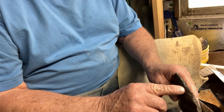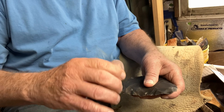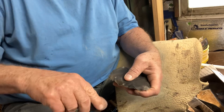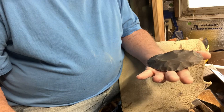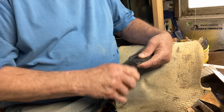I've got this continuous platform through here. It's a flat spot there and a ridge here — I'm going to go over and hit it where the ridge is. I'm not going to worry about that continuous flat spot right now. There's a high area with a platform right here, and I'm going to work it down some. Grind it good, try to come right through here, set my tool like this and come down. Now I'm going to work on the tip down here, just striking down like this — it raises the edge up.